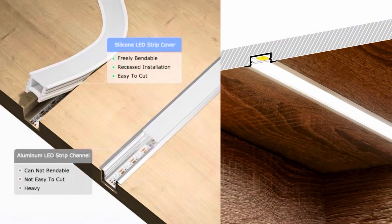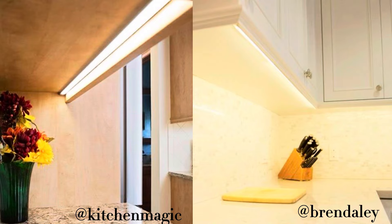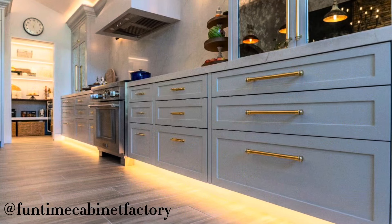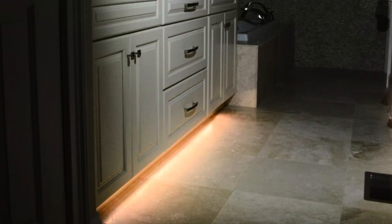If you're going to use that channel, there are really only two ways to do it properly. If you're doing new cabinetry, you can integrate it into the bottom of your cabinets by recessing it using a faux bottom. The other way is to make the front of the cabinet boxes longer to hide it. There's also a third way using a light rail — a trim detail at the bottom of cabinets — which is a more traditional look. If you already have cabinets and want a sleek solution, we've also featured rechargeable, motion-sensor light bars found on Amazon that work really well under cabinets.